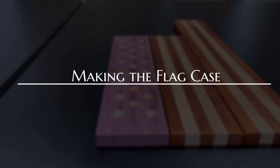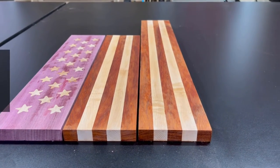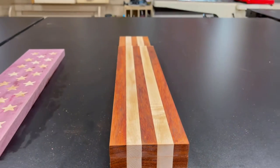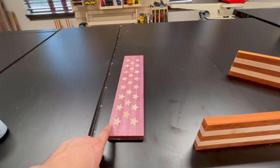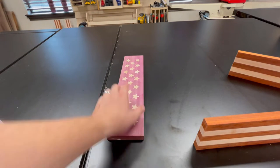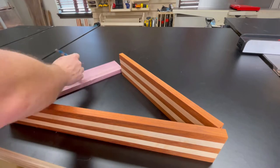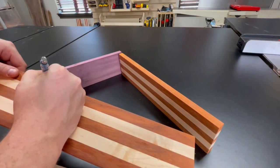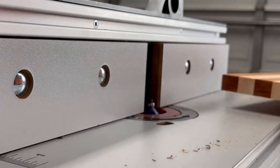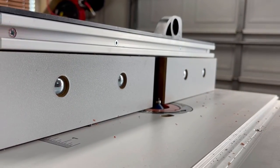From this point onwards, the steps to create the flag case — whether stars and stripes or a more traditional design — are exactly the same, assuming you start out with boards of this dimension. If you go with the stars and stripes design, make sure your stripes are aligned properly, since your pattern is probably not symmetrical both ways. The stars are positioned closer to the left edge than the right edge, because we're going to cut off a piece of the right side as molding later. I then mark which edges are going to be routed and chose to route them with a simple chamfer bit — the design is already pretty busy, so I didn't want very intricate molding.